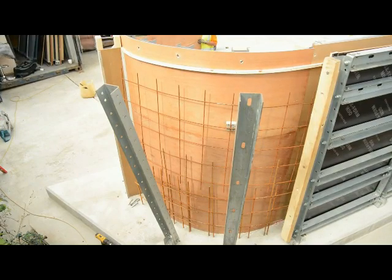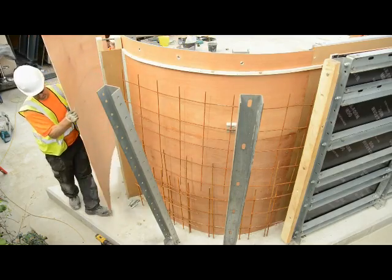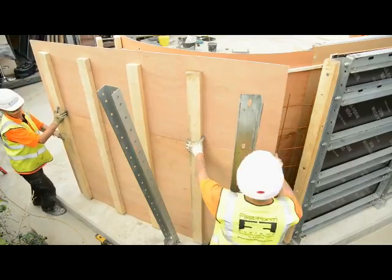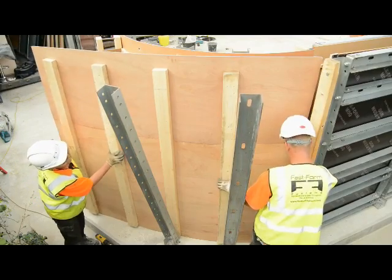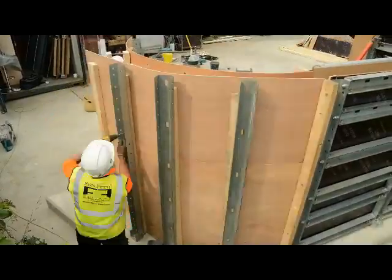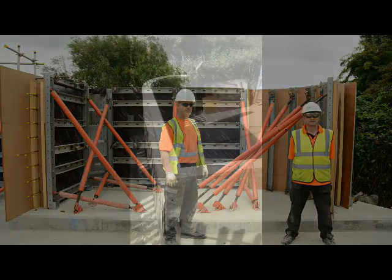With the main wall all in position and fixed, the corner braces are on and all bolted up. We're now going to start installing the external wall on the radius shutter. We first fix the first two uprights in position and we've made a panel putting 4 by 2s onto the back of the 6mm plywood. These are going to line up with the uprights, and once in position the timber is going to be screwed to the uprights from behind as we've done before. Thanks for watching — that's how we set up a corner, a straight wall, and a radius wall using the Fastform 1.9 system.